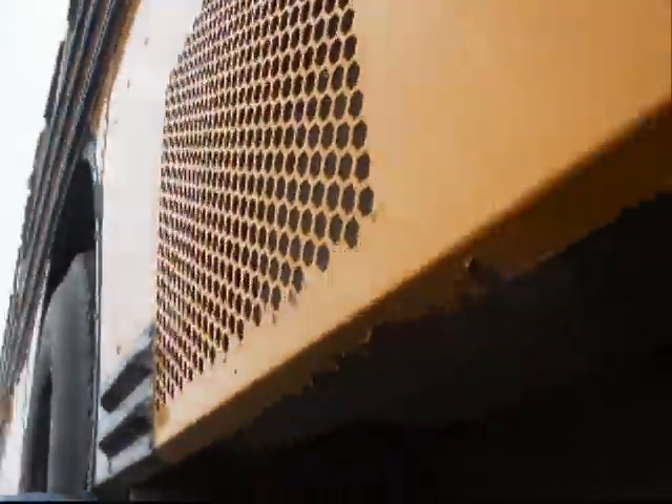Another part of this cooling system is this hydraulic cooler. It has an electric fan that runs on it, and if the power steering fluid gets too hot, this fan will activate. The sensor for that fan is located at the bottom of the reservoir.